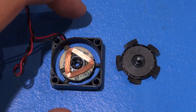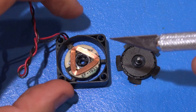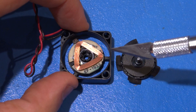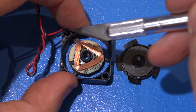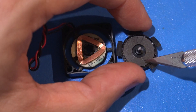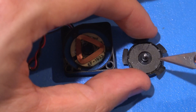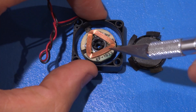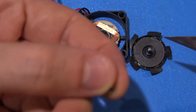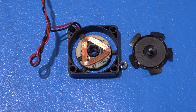I like the design of this brushless fan — it's a little different in order to achieve a very low profile. This coil, combined with this controller, can create magnetic fields in different corners. This is of course a brushless system, which means you need a permanent magnet around it. Normally we see coils in the middle and a cylinder of permanent magnet around it, but in this case the magnet is totally flat. When I move around it, I can feel the different poles distributed on the surface of this disc. By sequentially changing the field, it allows the fan to rotate, giving it a really low profile. I just need to get appropriate lubrication into this little bearing and that should remove the noise.